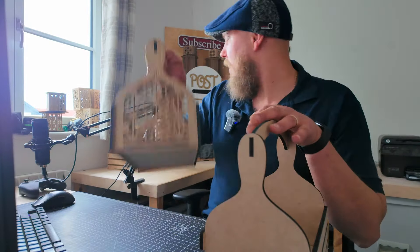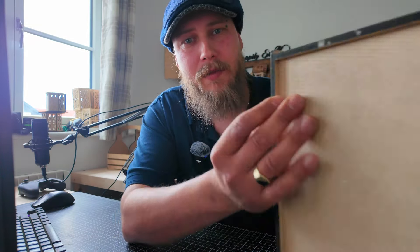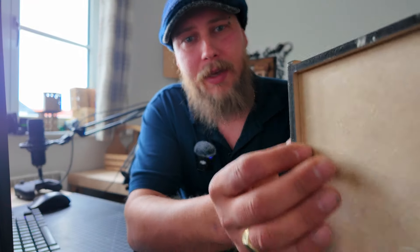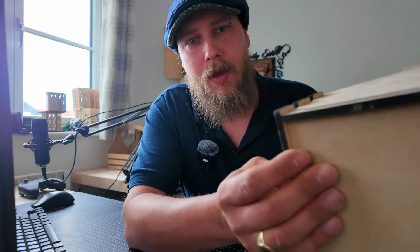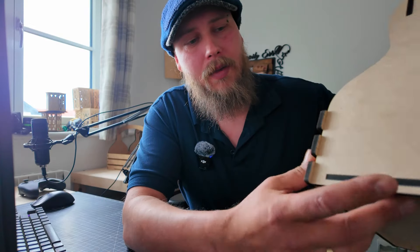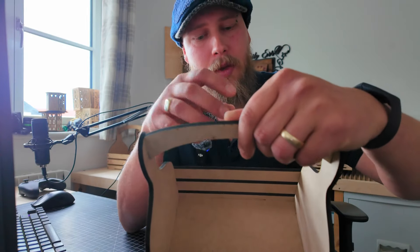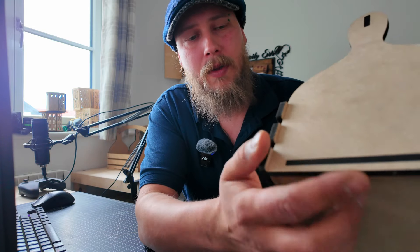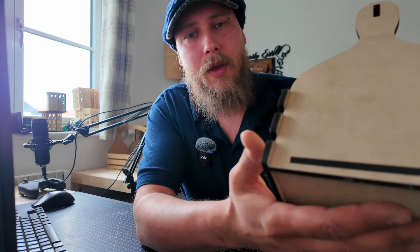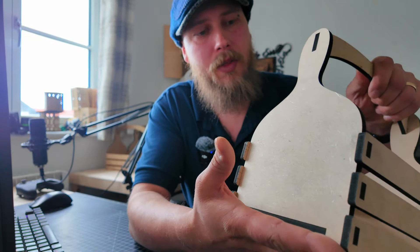This project is made up of six components. First of all we have our base, which is offset from the bottom so we have a lip here. We've got a lip here that this finger joint rests on — that way it gives us more support if you want to put something heavier in these. If they were just a standard finger joint we're just relying on the glue to hold it, whereas this has support on the bottom.